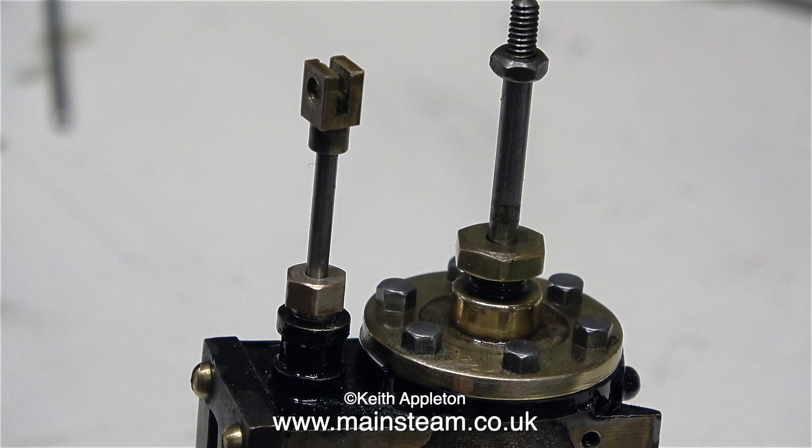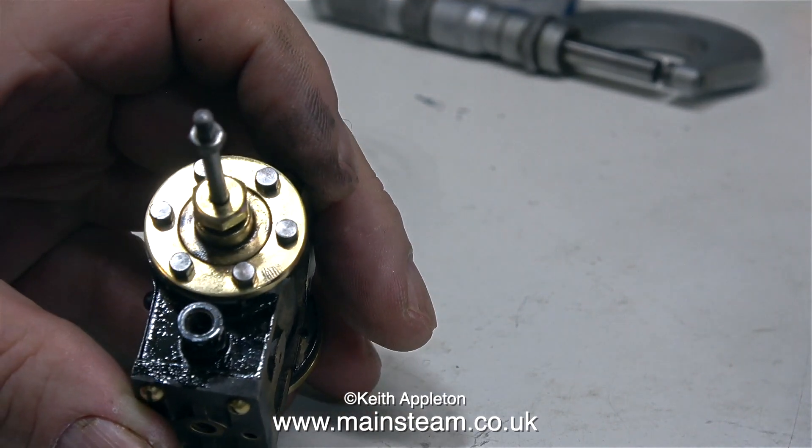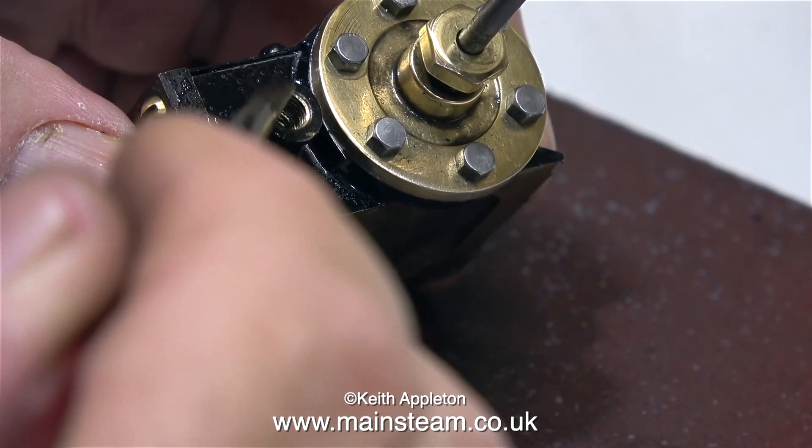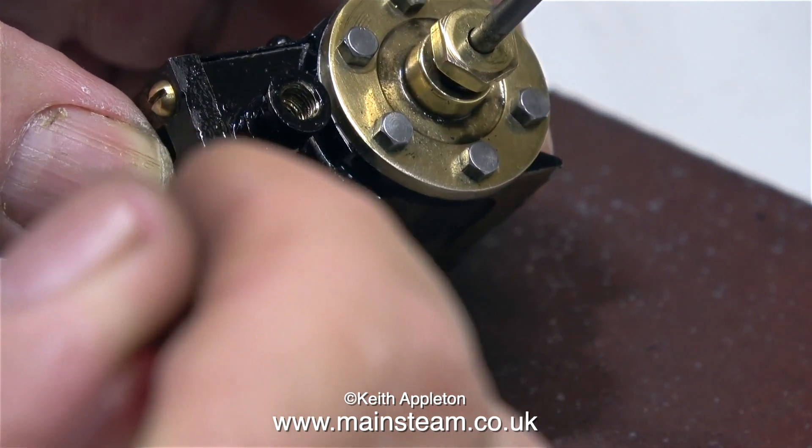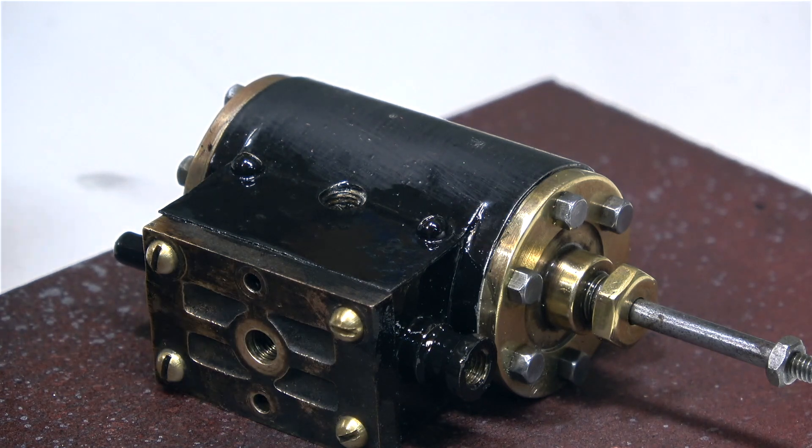You will notice that the shape of the gland nut is slightly different to the main gland nut on the piston rod — I've left the nut part a bit longer, and this is intentional as it gives a little bit more support for the valve rod along its length. I think this part of the job is now satisfactory, but no sooner do I fit it than I remove it, because I need to give the cylinder another coat of paint. That's it for this episode, thanks for watching and I hope you found it useful.